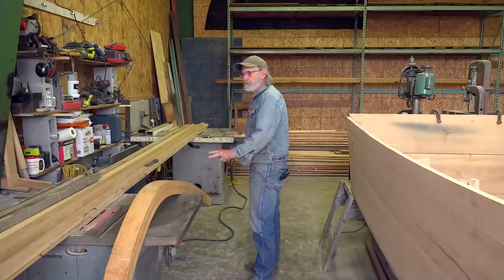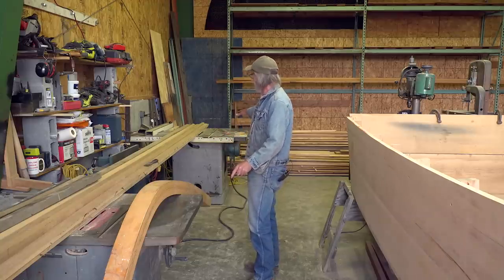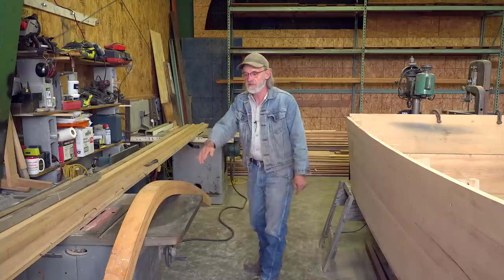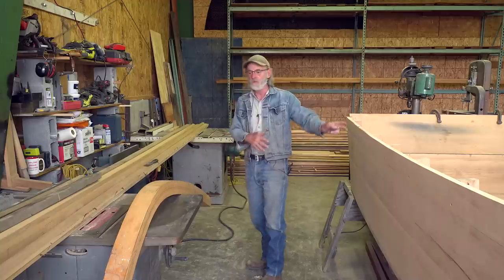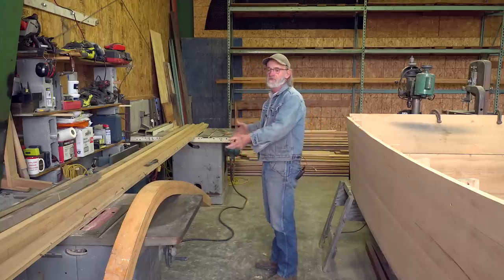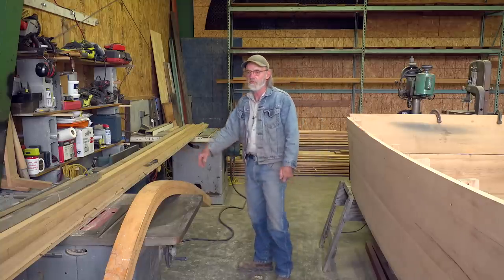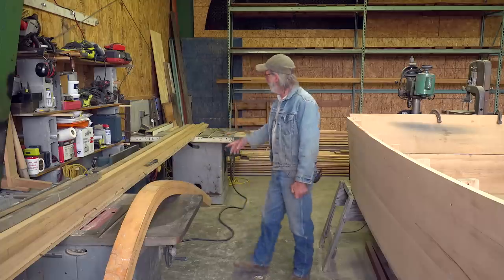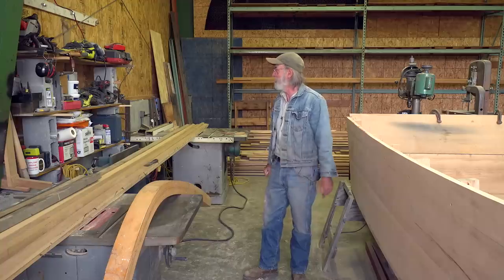I love this setup with two table saws — I've got a heavy-duty one and a lighter-duty one, but they're the same height, so I can rip off one onto the other and it acts like a workbench. I can lay something out there and clamp it down. I don't have a woodworking bench with a bench vise and all that; I use these two table saws as a workstation. I've got a little jointer that's portable, a portable planer, and my phase converter up there — this is three-phase and I've only got single-phase coming into the building, so we've got that to operate properly.